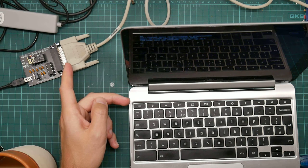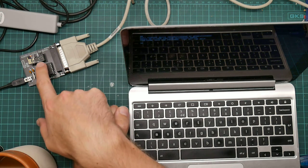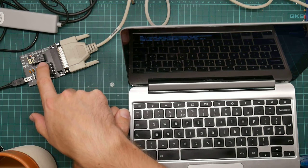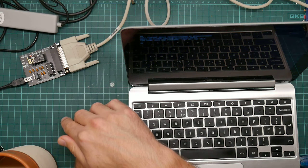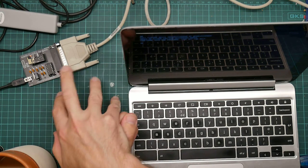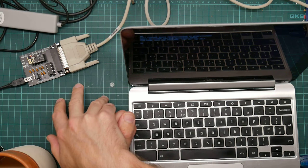See, the thing is that most modern machines, when you use serial, they don't use CTS, RTS. In particular, the very simple TTL serial interfaces that microcontrollers use, which just have two pins, which is TX and RX, with no handshaking whatsoever. The days of XON, XOFF, and SI, SO, and CTS, RTS handshaking are well and truly over. But the two computers I tried it on, being quite elderly, seem to assume that it is a thing.